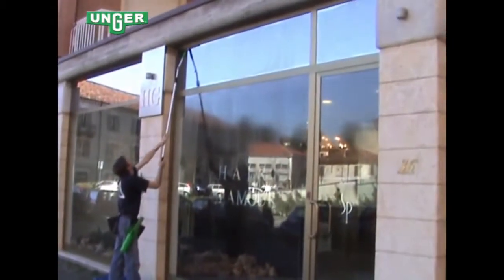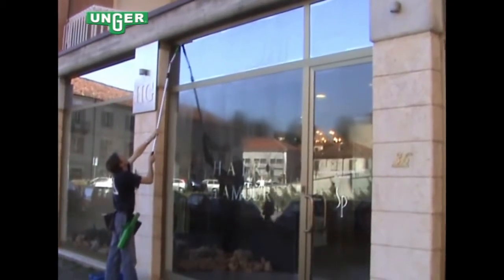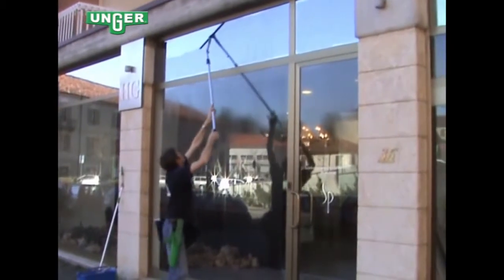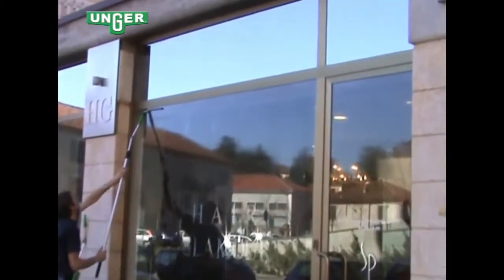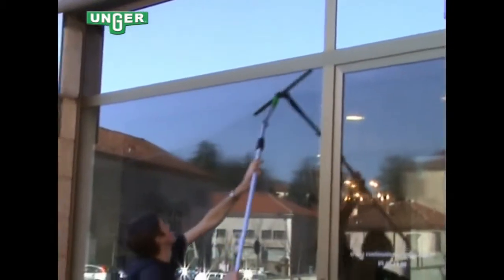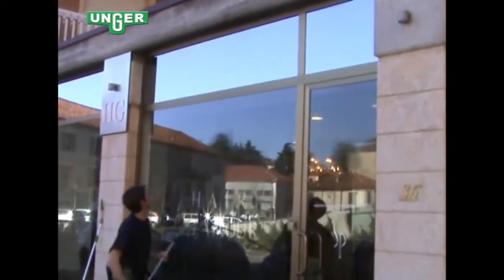Cut in at the top edge by drawing the water away from the frame with a few short downward strokes of the squeegee. We'll call this feathering. Turn the blade and run along the top edge. Use little pressure so that you can feel the frame as a guide. At the opposite corner, complete the stroke by pulling downwards. We'll call this the 7 technique.